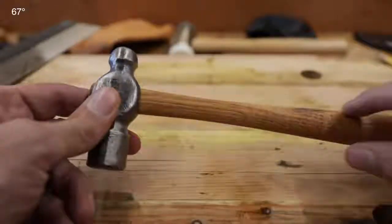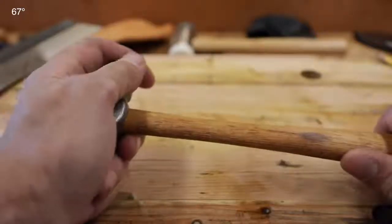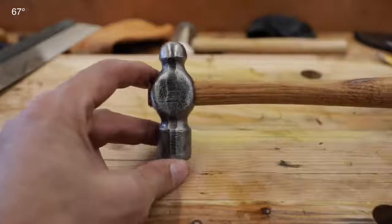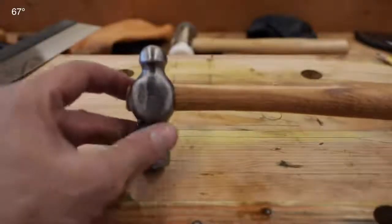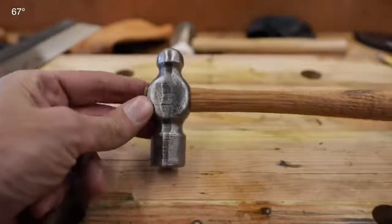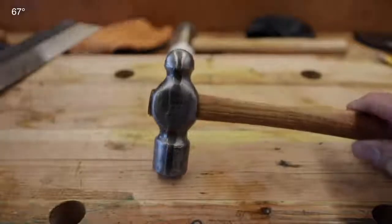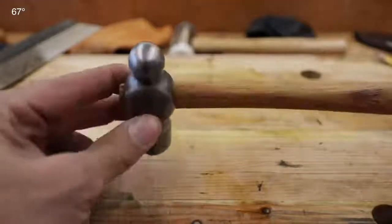Nothing like hickory. These little hammers are really delightful to use because that three-quarter to half-inch taper gives a lot of snap — it whips. It actually bends and springs back, and that's what makes hickory such a wonderful tool handle wood: it has that spring, that liveliness as the old-timers described it. Oak or different maples are tough enough for handles, but they're dead — they don't have that spring. The thinner it is, the more pronounced that is. It almost feels like it's assisting you. Granddad had his hammers with that very slight, really small form — mine is even a little smaller, maybe a bit too small, but still good.